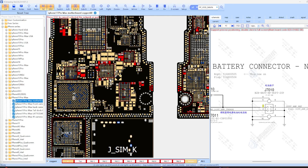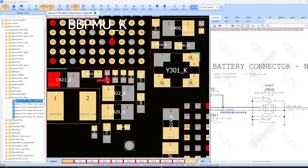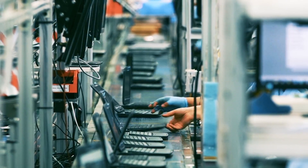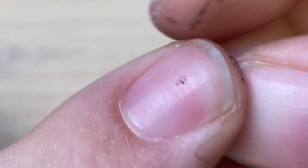Looking in this area, this is the area that was getting hot, and the only component — this little capacitor here — was getting hot. So let's pop that off. Now these were only a few of the methods that can be used to find a short. The boards had to come apart to find it. There are a variety of thermal cameras and other methods to detect the failed component. Given that it's a single small capacitor, we could replace it, but the device will most likely function without it — like getting rid of one out of a thousand in an assembly line. It'll probably still flow; it may not be as proficient, but it will work. And there it is — that little guy pulled off.